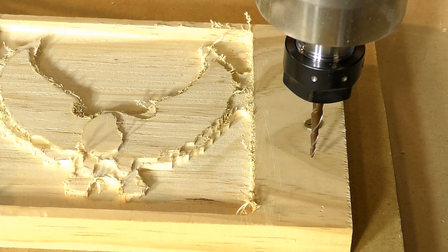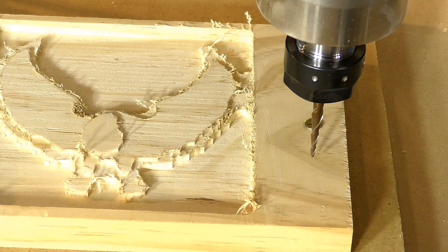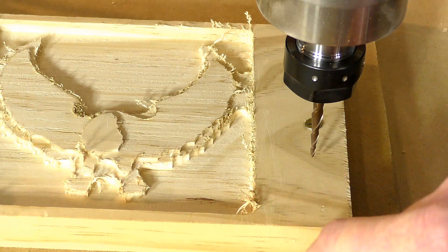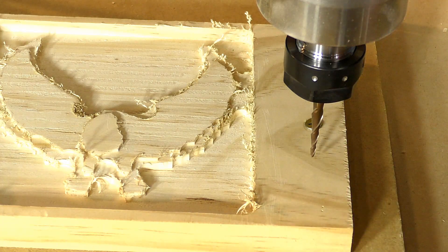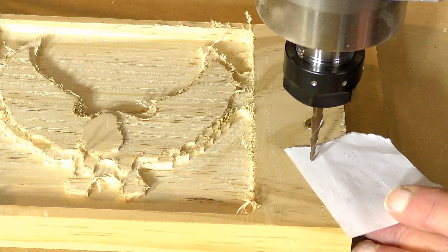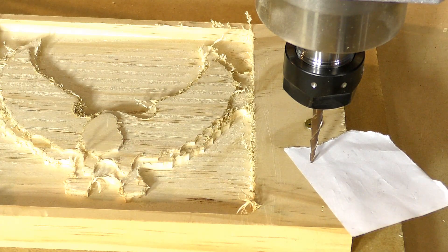After a bit of a haircut — and a lot of people ask me how do you get the new Z zero for the new tool — well, very simple. All this material is flat, so I could do it here or anywhere on this material that hasn't been cut. If all the material was trimmed down, all you'd need is just a cut-off piece of this material placed where your material is clamped, and you can Z-zero off that. Same trick again: bit of paper underneath, bring it down very slowly until it just touches the paper, and we'll zero that and do the next finishing cut.